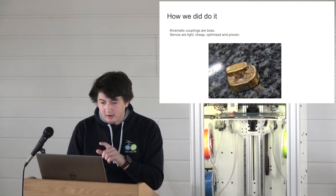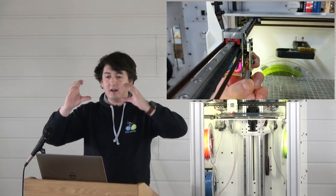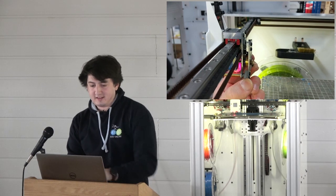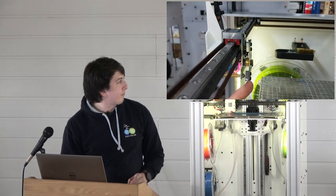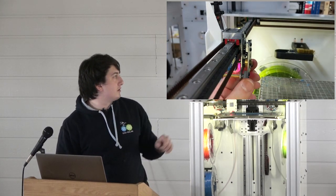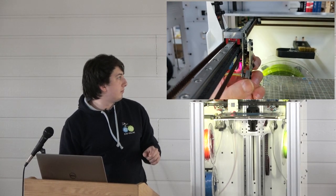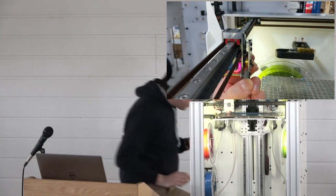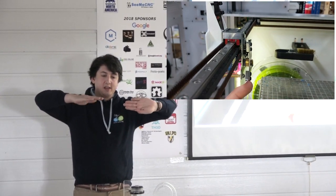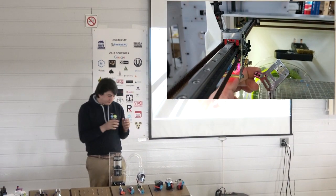Now, what you can't see is that this isn't just a T-bar. This T piece here, can you see my mouse on the screen? This T piece goes into that slot, and then it rotates. Now, watch more carefully. The T piece is not just T-shaped, it's got angled cam surfaces on it, and it's on a rod that is sprung.